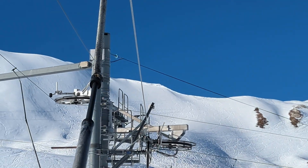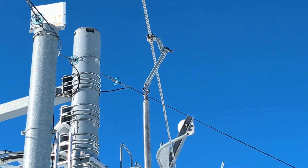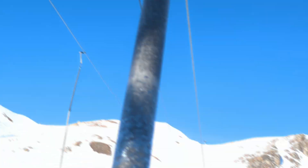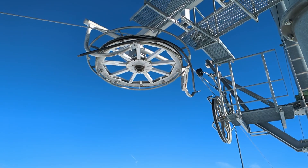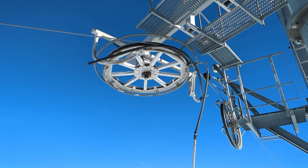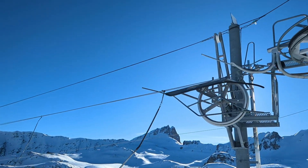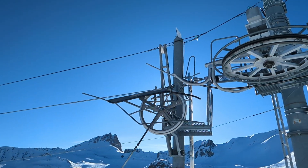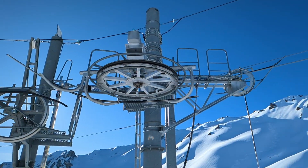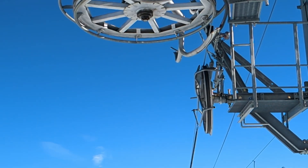The real innovation here is the fabulous outward turn. Note how the grip is located at the wrong side — it's about to slam into the pulley. But wait, what just happened? Let's check this out in slow-mo. The guide rails simply slam the grip to the side in order to make it face away from the pulley. No careful guiding in advance, no avoiding the outward turn — just bang. What doesn't fit will be made to. This is what I mean by a brute force solution.